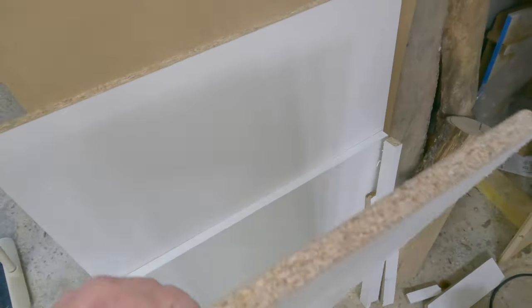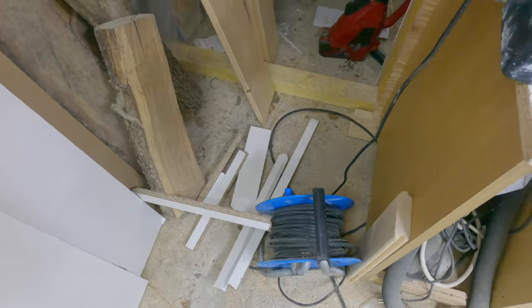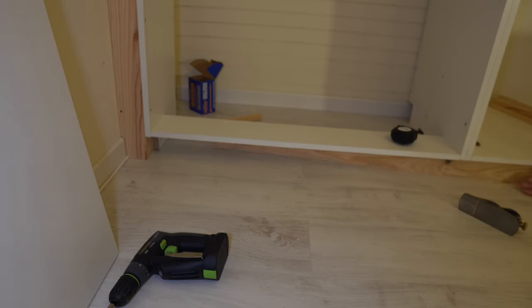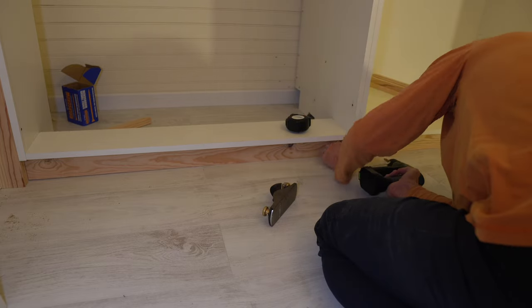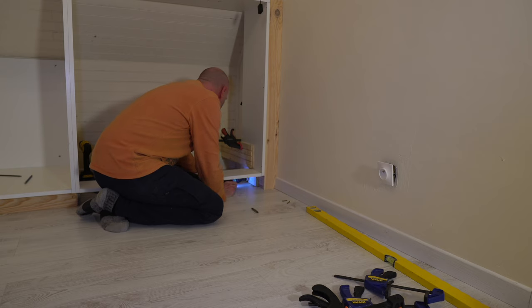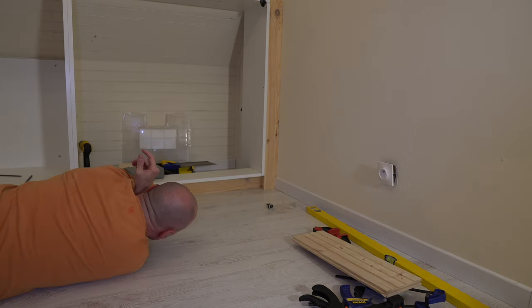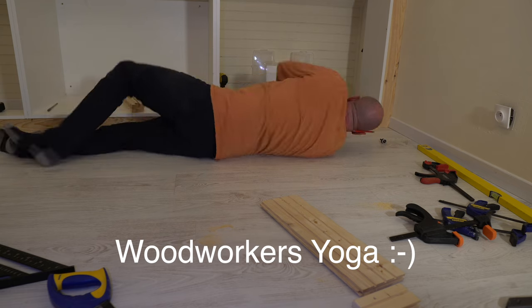I'm also cutting the three shelves for the central unit. After I've finished with my melamine faced chipboard, this is what's left from the four sheets. The plinths are in four parts: two small returns on each end, and then the long piece which is made from two pieces along the front. The plinths are just screwed to the melamine faced chipboard bearers behind them, screwed at an angle so the screws can't readily be seen.